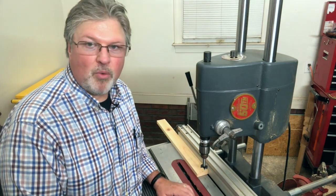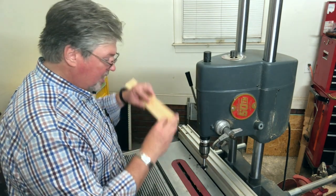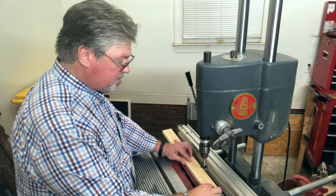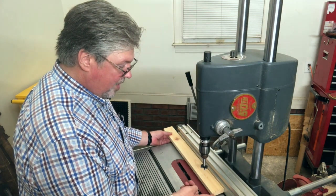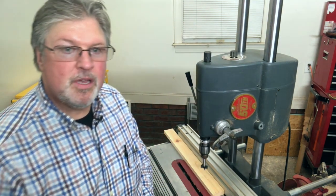The other thing you've got to watch out for is the buildup of sawdust. If I'm drilling and drilling and drilling and I lay the next piece on top of some dust, that's going to raise it up and cause it to drill deeper. That's it for today — I hope that's helpful to you. I appreciate any comments that you have, and let me know where you want us to go from here. Make it a great week.